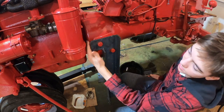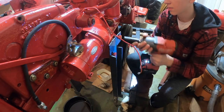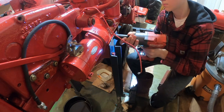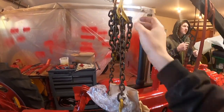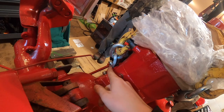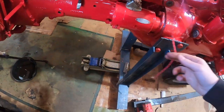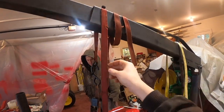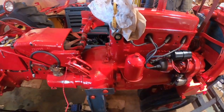Here's how I have this rigged up: this chain splitter going to this bolt hole with the 3/8 grade 8 bolt and this lifting eye, same thing over here where the air cleaner went. Then I have the splitting stand set up there with the jack, and I have the strap here with a safety so that the front end doesn't want to tilt either way. Now I can start taking these bolts off.